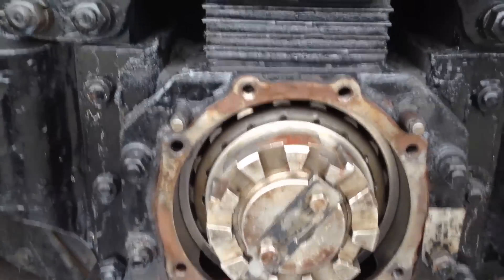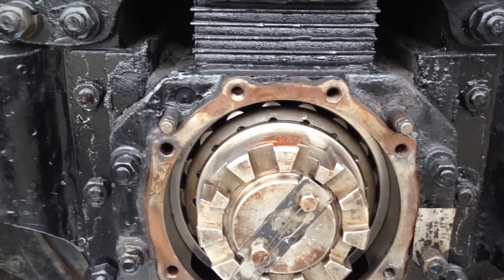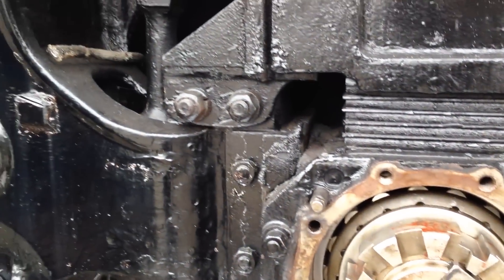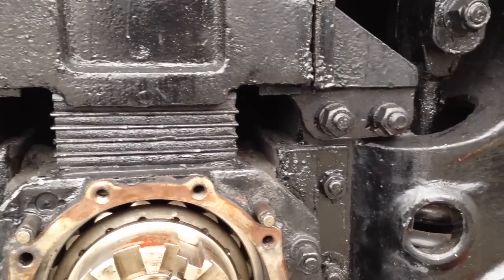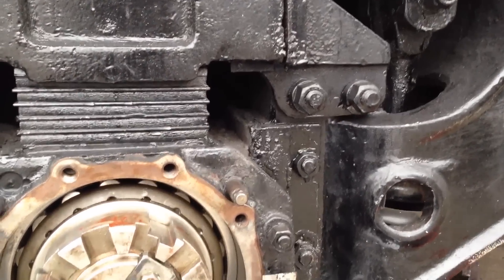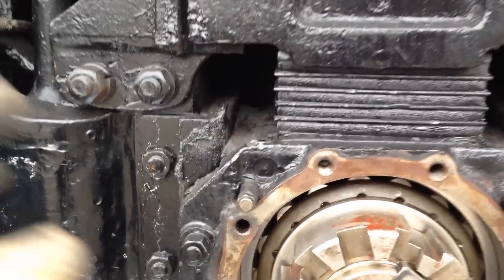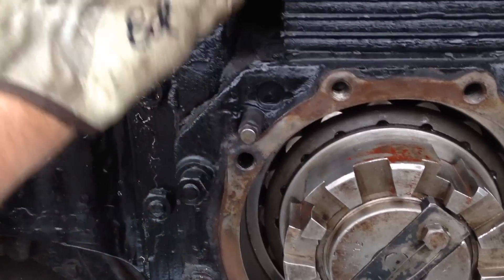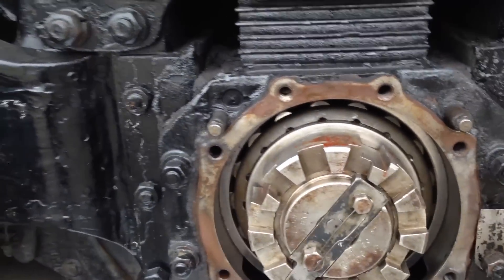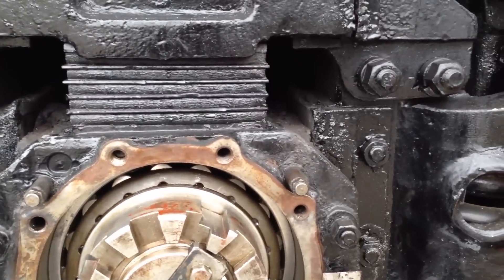On the box itself, the pedestal surfaces, we'll clean those out. Immediately upon arrival here, a little over a month ago, we began putting a special compound on the locomotive to start breaking things up and help in the process of lubricating. We will go through and remove all these button head fittings and service all of the pedestal surfaces that we can, working down in there to remove as much of that old dried lubricant.